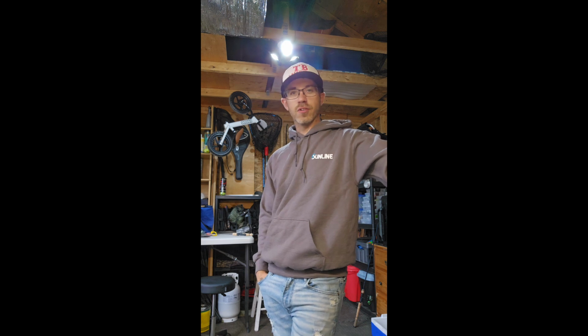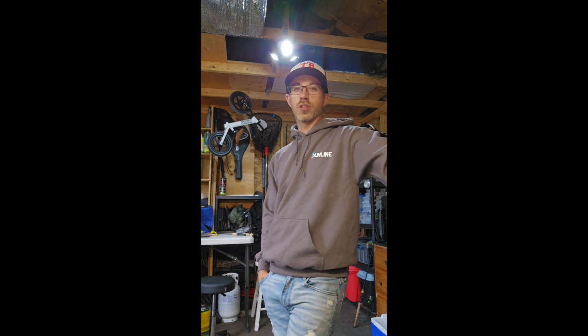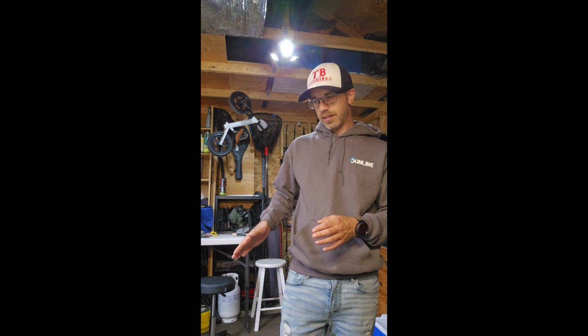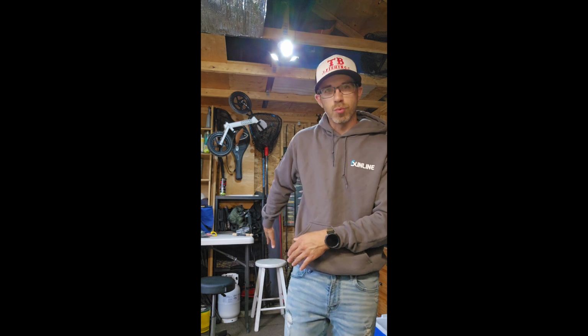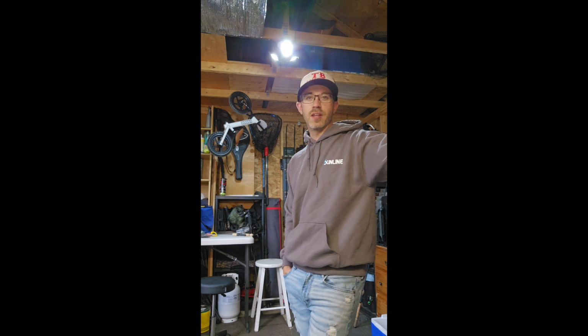It offers a massive amount of responsiveness. With the motor, like I said, most people running a motor know that that's an issue. That's a really big shortcoming with putting a motor on the back of your kayak that is rudder controlled. So if you do your rudder change properly and make sure your cables aren't super loose, you'll be fine. An issue that almost everyone has with the Old Towns is that the rudder doesn't stay down in the deployed position firmly. You get a lot of rudder ride on these kayaks, and I'm really hoping that Old Town is going to recognize and fix that. I'm sure that I'm not the only one saying it. I know I'm not the only one. I read it almost daily on the boards.